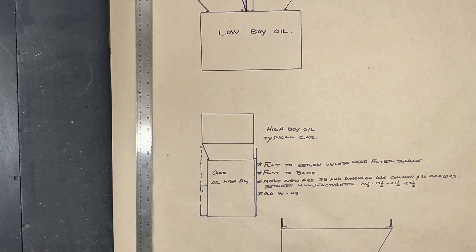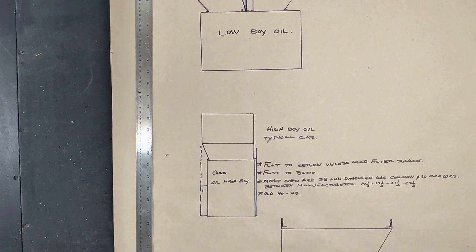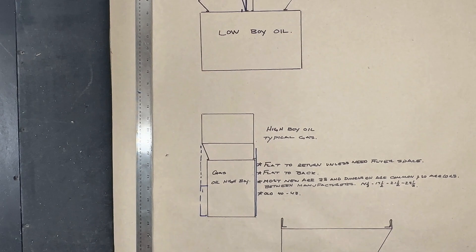I always try and keep at least two flat sides on everything — it makes your life a little easier. With the new furnaces and new gas furnaces and case coils, everybody's pretty much got the same measurements now. Back in the day a majority of units were between 40 and 43 inches, but now they seem to be coming through about 33 to 34 inches, so you're always going to have a lot of room to make a transition. I always try and stay flat to one side and flat to the back, depending on what I have. Every job is different.